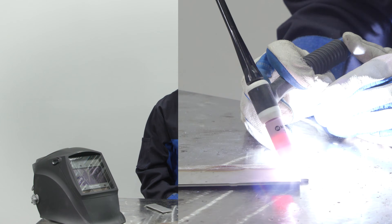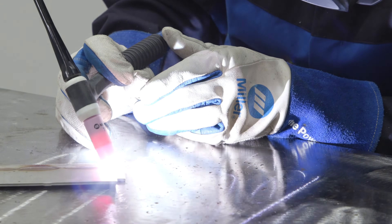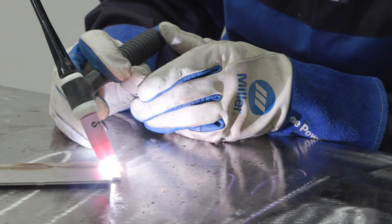If you do a lot of welding on thin, mild, or carbon steel, pulsing is a great option to help reduce your heat input and improve your directional control. This can help you get the arc more easily positioned or directed where you want it to go.